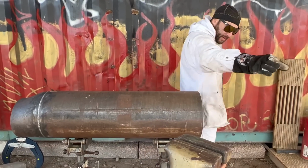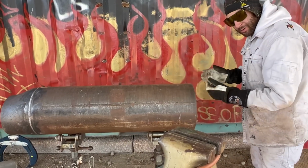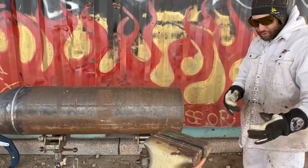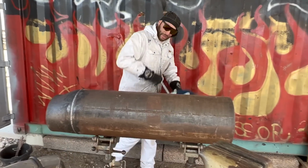And all I'm trying to explain right now basically is that I have to orientate the pipe the right way so the 90 can go the way it needs to go. And then I'm going to teach you guys how to roll it out and counterweight this 90 facing this way with the eccentric like the way it is.